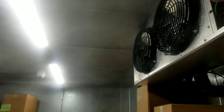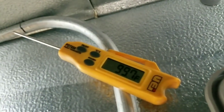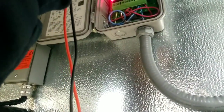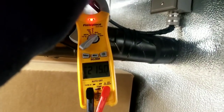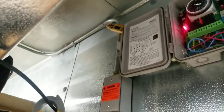We are now 39 minutes into our defrost cycle. Air temperature in front of the evaporator is 62 degrees. We have about 100 degrees of air behind the evaporator. Let's double check the brand new defrost termination switch I installed on one of my previous visits — as you can tell it is not trying to kick us out of defrost.